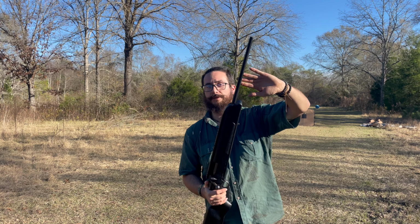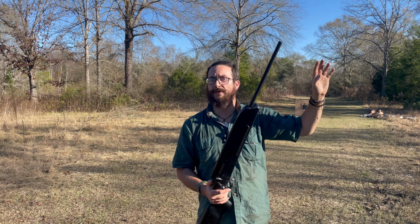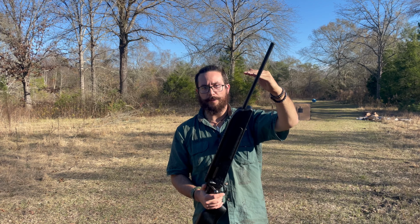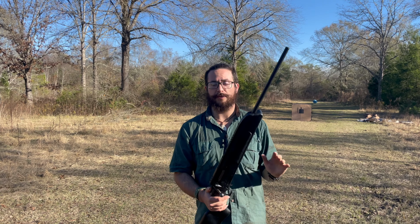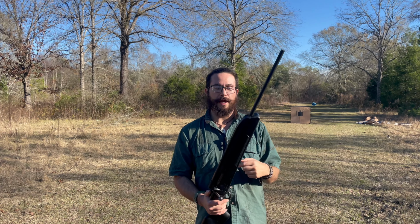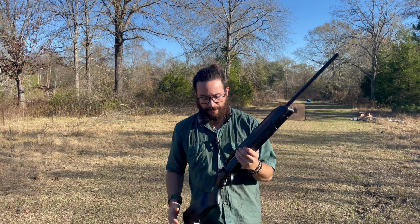We've already measured out where the bulge is, and it's at like 23 inches, so it's fine. We're going to cut about an inch below the bulge, recrown it, and do our best to make sure there's no micro fractures that are further down after we cut it. And we'll bring this thing back out after we get it recrowned, and we'll fire it for y'all.